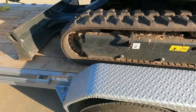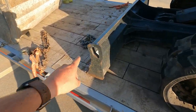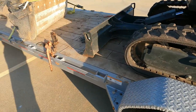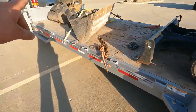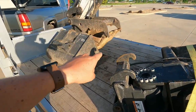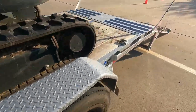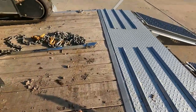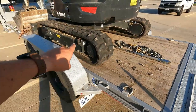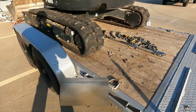We're going to go from our stake pocket up to this hook right here — same thing on both front sides. You can also go up through here and across the push blade and over to the other side. Over here on the bucket we will be doing a strap from stake pocket to stake pocket. On the back side we will run a chain through each of these D-rings and up through the hook underneath. There is also a hook on the side where if you wanted to do four points you could do one on each corner.